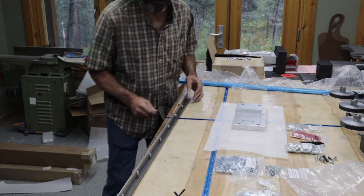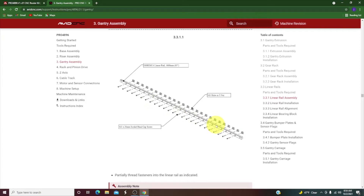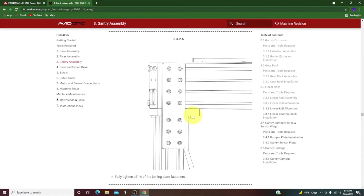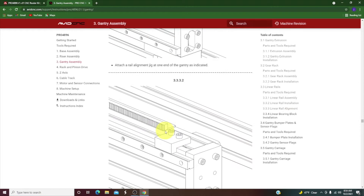It's a lot of nuts and bolts in this project but it's fun. After assembling the linear rails the next thing is to put the end cap back on. Then comes an important step for linear rail alignment — just like on the bottom Y-axis, we need to do the same thing on the X-axis up here. We use the rail alignment jig on both sides, tighten all the top holes and leave the bottom loose, then tighten the bottom in the future.